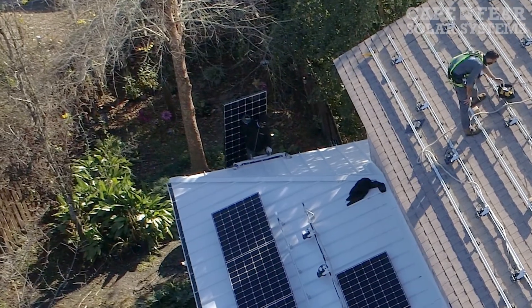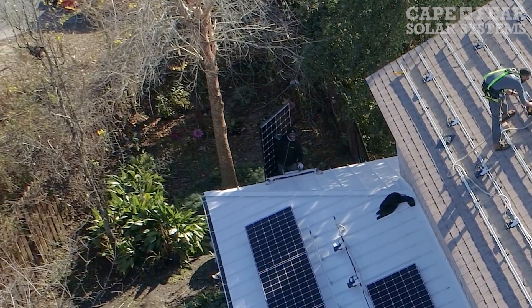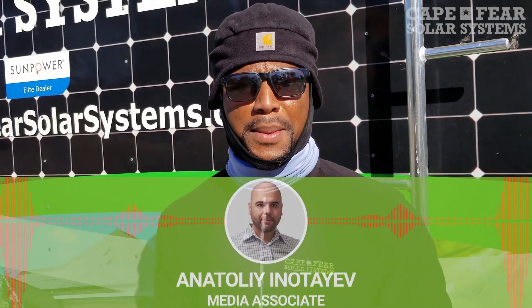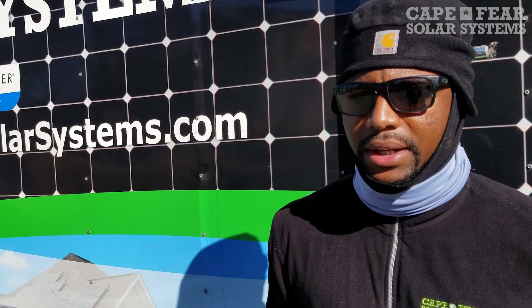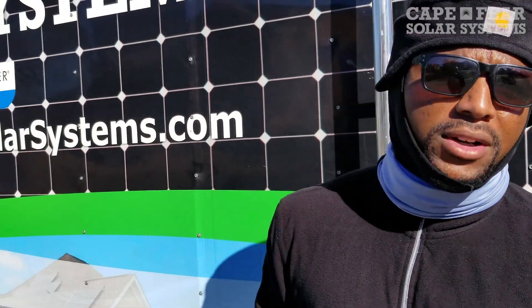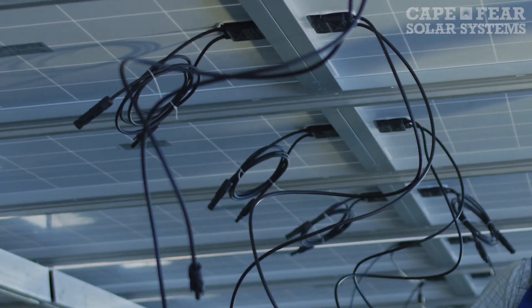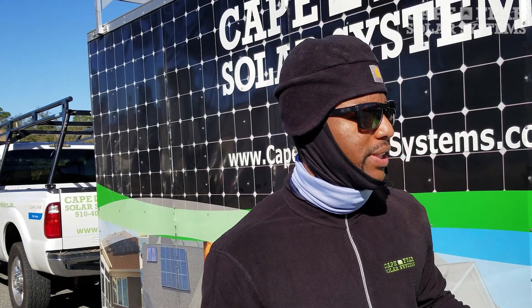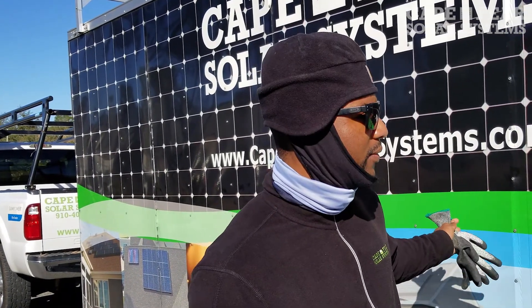Installs include anything from panel work, rail work, electrical work in collaboration with our electrician, and of course our team lead. What do you do first from the time you arrive? Prepping everything we need beforehand, so when we get on the roof there's no delay. Prepping looks like anything from cutting the wires off the back of the panels, to splicing rails, to getting attachments ready to be placed into the roof, as well as doing the walkthrough of the roof and attic. We'll prep usually in a general area convenient for the customer but also for us — a backyard, front yard, or inside of the work truck.